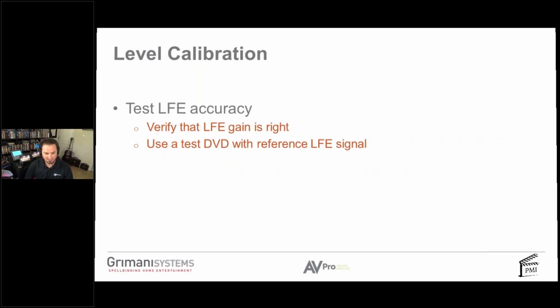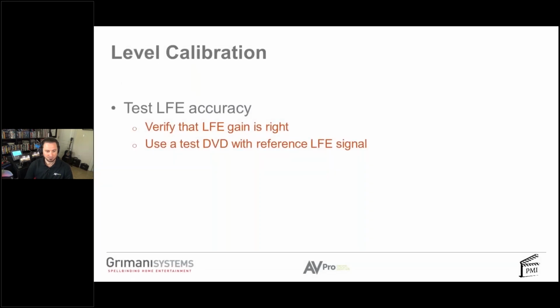Keep hitting the button here. So the 5.1 toolkit does have a series of tests that show here's low frequency in the LFE only. Here's low frequency in the center. The same low frequency should come out at the same level. It's actually offset by 10 dB between the two. This is another example of how this course really needs to be 2 days long to explain all those things.